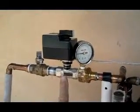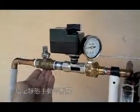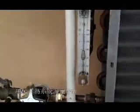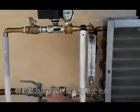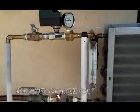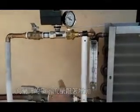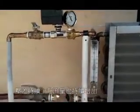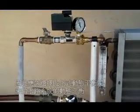Right here we have a really good quality two-way characterized ball valve — it is modulating. We have this manual balancing valve balanced to where the system is running at two gallons a minute. Now I'm going to pull back so you can see everything happening at once. I'm going to increase the pressure with the regulator, and you should be able to see the gauge go up with pressure, along with the flow. That's why you need to spend money on a good quality PICV valve.